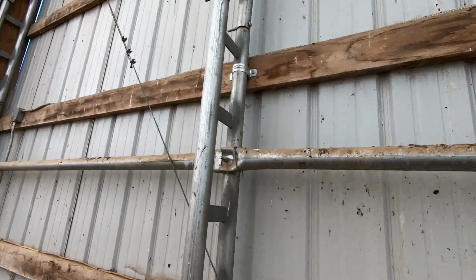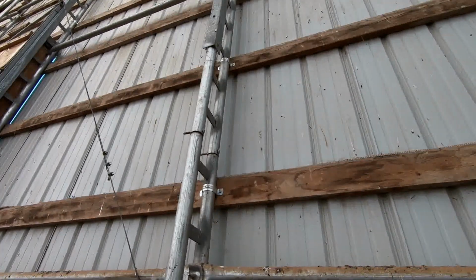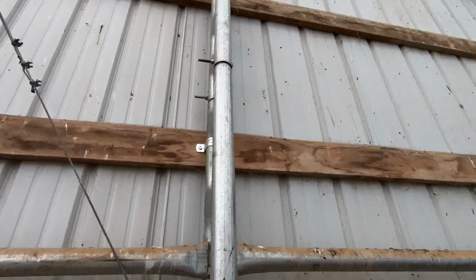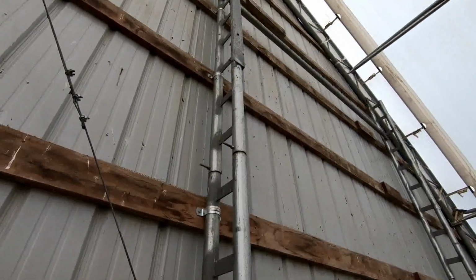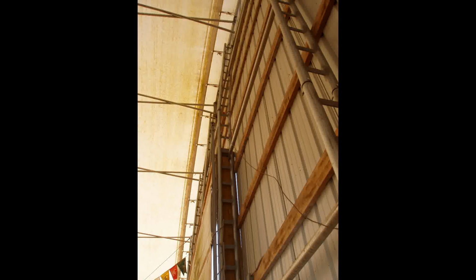The end walls are supported by metal truss-like columns. They came in 10-foot lengths and fit together by sliding into one another. A bolt was inserted through the joint to hold it together. Unfortunately, the builder chose to run the bolts parallel to the face of the wall. This allowed the joint to act like a hinge. One day in a 60 mile per hour wind, the back wall of the arena was blowing in 8 inches in the gust. Steel angles had to be added with the connecting bolts running perpendicular to the wall.